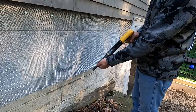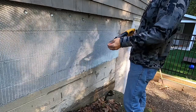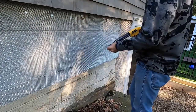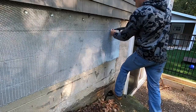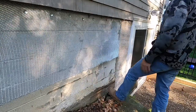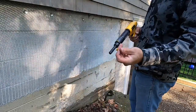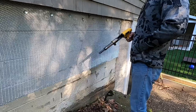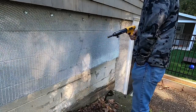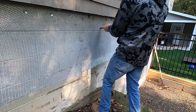Load the 22 shot, close it, grab your nail, shove the little rubber part in there, and grab a washer. Push against the surface — oh, it held the shot right to the washer. If that happens, the little rubber part was slid back too far. Load another 22 shot, push it to the rubber part, grab the washer, push against the surface.